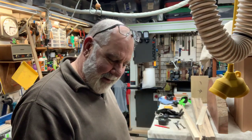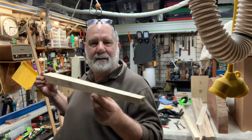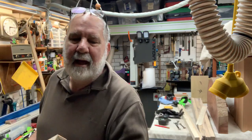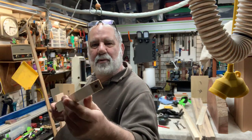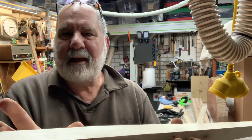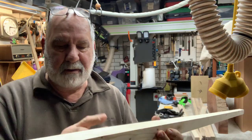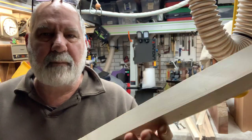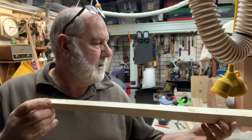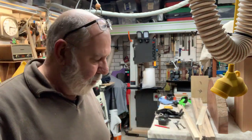So what I did — I made up a jig to make tapered legs, and it's really cool. It's about 45 by 45 at this end and around 20 by 20 at the other end, all four sides equal. It's got a little flat section for about 150 millimetres, which I designed it for. This is just a piece of cheap pine as a sample to test out my unit, but it turned out great and it was really easy to do.